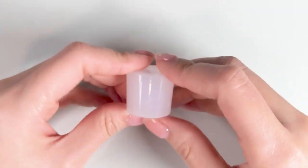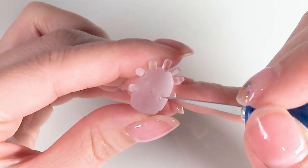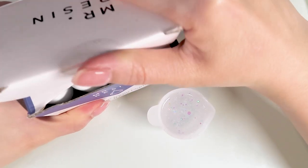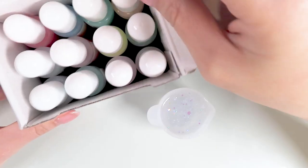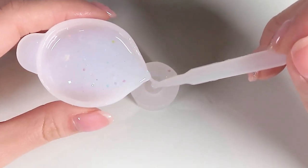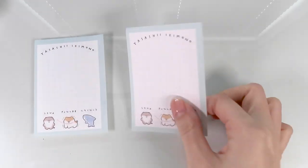And yeah, it was pretty difficult. I had to poke it around with tools to get all the cavities filled. But after the casting, it looked really good for the most part, except I found that there was unfortunately a bubble in the mold — that 10% I was talking about earlier. But not too much to worry about because I was able to actually just remove it with a knife. Now, I'm going to pour in some colored resin. I pulled out my new box of Mr. Resin pigments and found out that there's actually no white in the 12-pack, but it's okay because I'll use white alcohol ink, which is one of the few opaque-ish alcohol ink colors that doesn't give me a lot of trouble with UV resin curing. Fill up the mold and then cure it in the UV lamp. When you pop out your resin piece and it seems cured on the outside but the inside is still squishy or not cured, you want to put the piece back into the lamp without the mold for another 2-3 minutes.